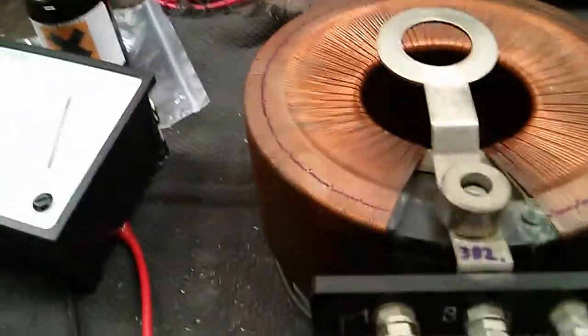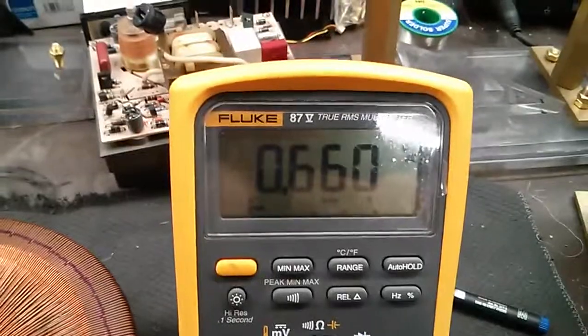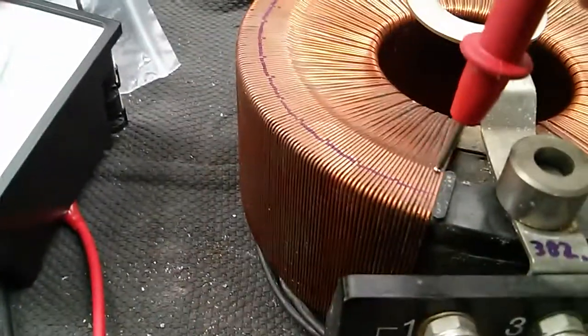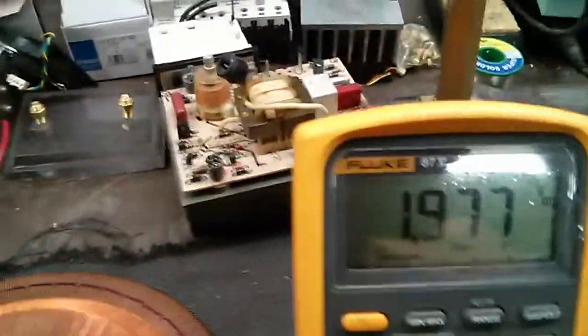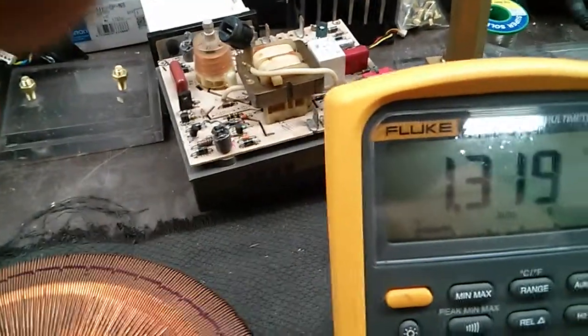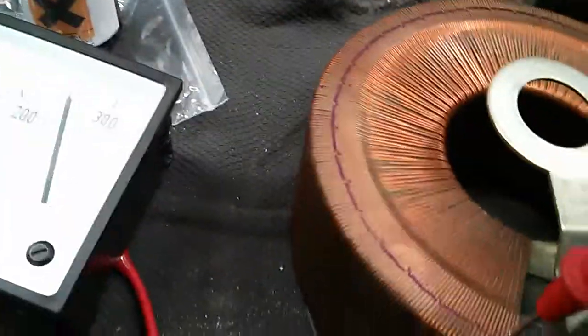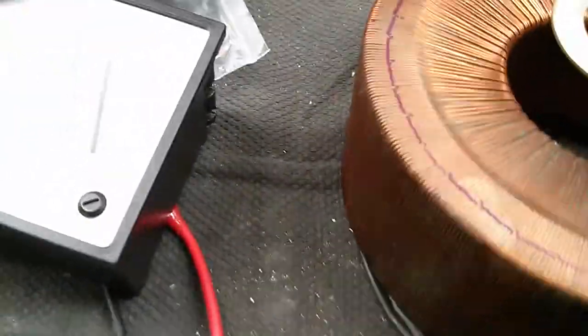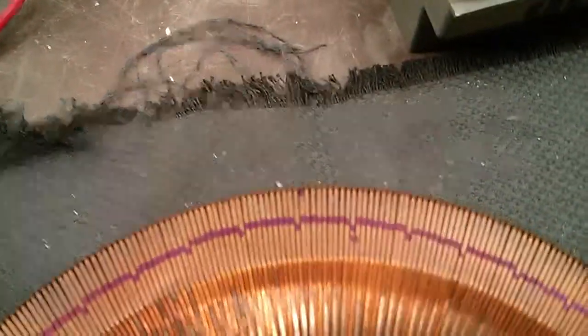So if I measure now with my probe very, very carefully sticking onto that winding - the first winding I can get 0.66 volts. So that's about right for the first winding. If I go up again, it's very tricky, it's very tiny - 1.3. So yeah, that's about it again. So what I've got here, there is a mark that shows 25% of the way around.